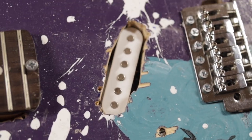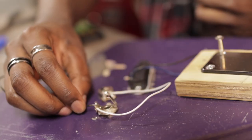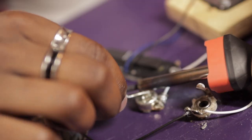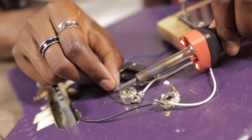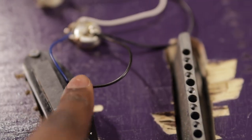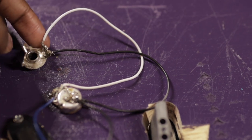The pickup sits under the wood a bit more than I would have wanted — maybe I'll try to find a cover. I sat down and ran through some diagrams to make sure I understood the routing path and signal transmission. If I didn't want to route the pickups to the volume knob, I could do a direct output straight into the jack. The soldering process was really difficult because the iron was pretty dirty. The soldering is incredibly messy — it's supposed to take five seconds, but it takes me 10 minutes. I have the pickup hot wire going into an input on the volume knob, the pickup ground going onto the volume pot, the output jack sleeve going into the ground on the volume pot, and the volume input running into the output jack tip.